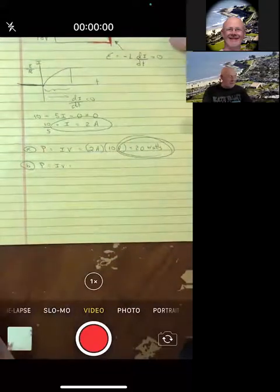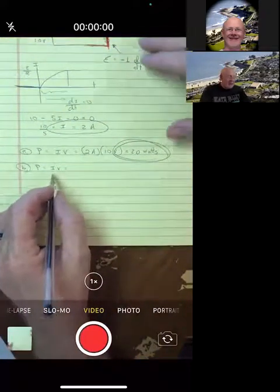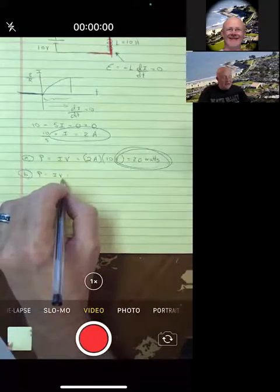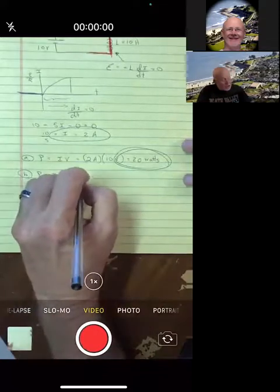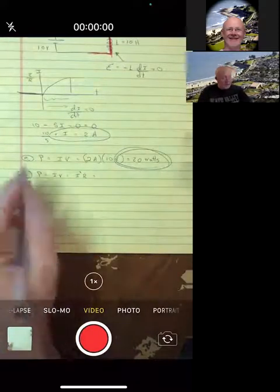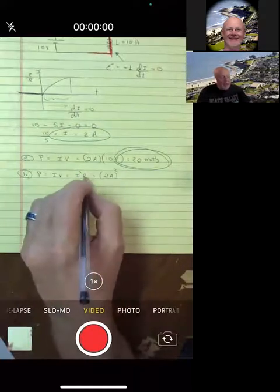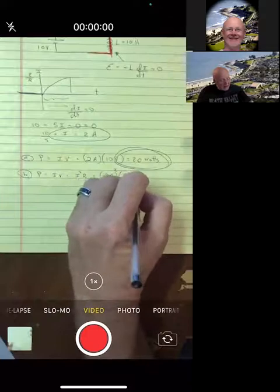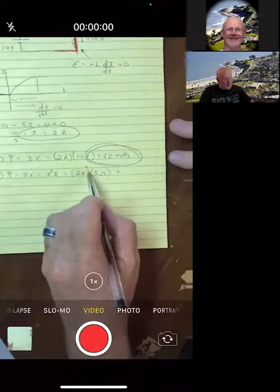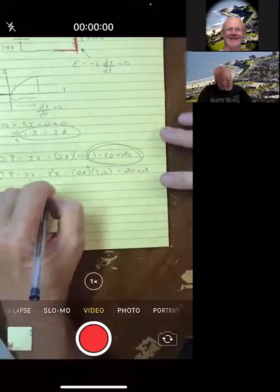But with that in mind, looking at the power in the resistor, we can again do I times V. We could do I squared R, and I'm probably more tempted to do that one for the resistor, because since it's in series, I know this is 2 amps, so I can square it. And I know the resistance is 5 ohms. So running through the math, 2 squared is 4, times 5 is 20 watts. But of course, not a surprise that this would work too.